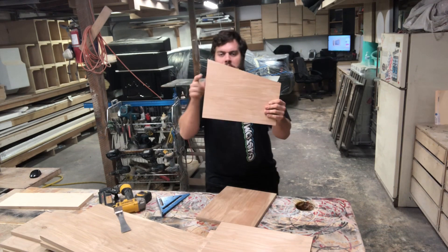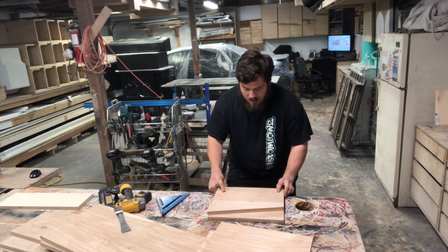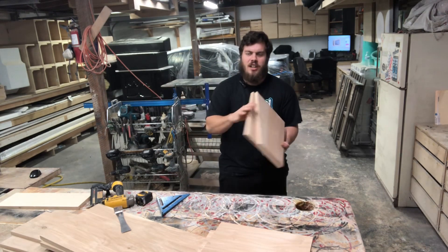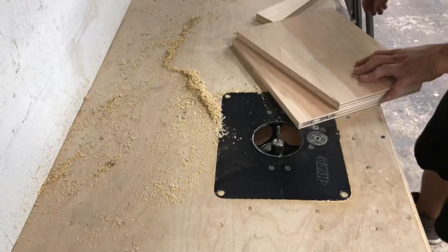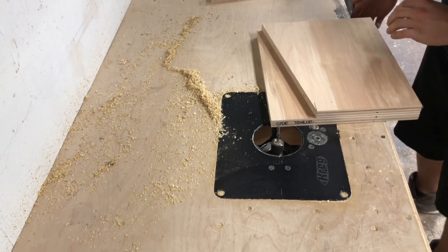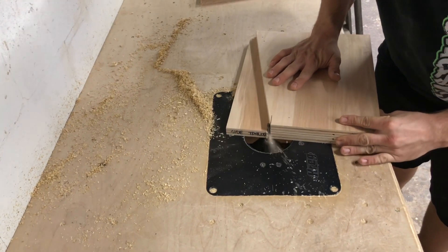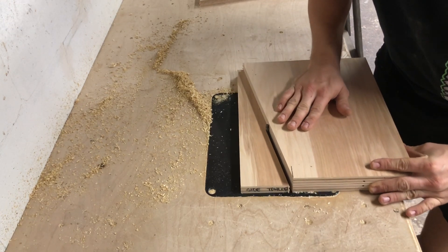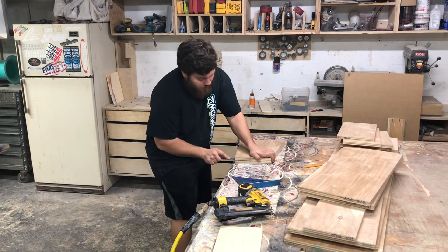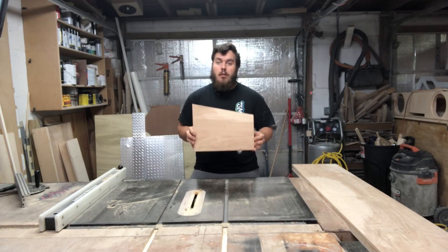Our first piece is routed out. We used that piece of scrap wood nailed on there as a guide for our bearing. We're now going to use this piece as our template for the next side piece. I've got our piece — you can see it has a slant; this is the front, this is the back. We're going to put it on our side piece lining up the sides, the front, the back, and the bottom, then take the brad nailer with three nails to hold it. Both side pieces are done and the side pieces are really the key to the entire underseat build process.